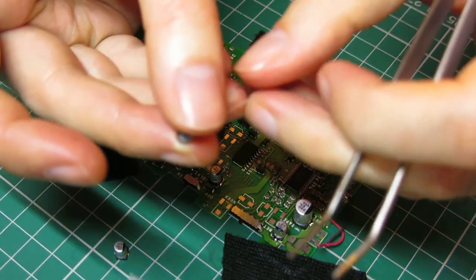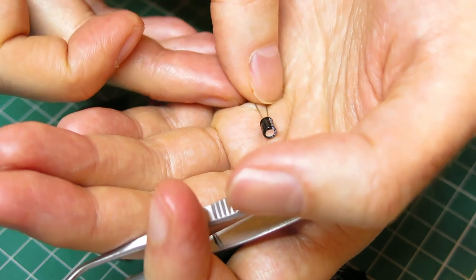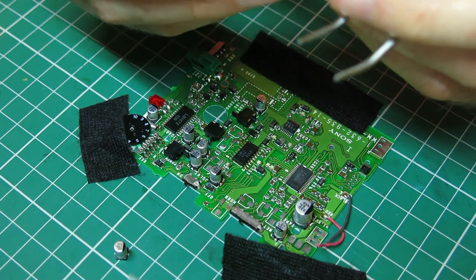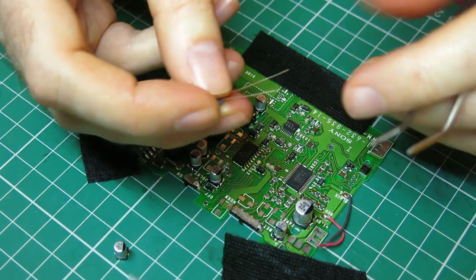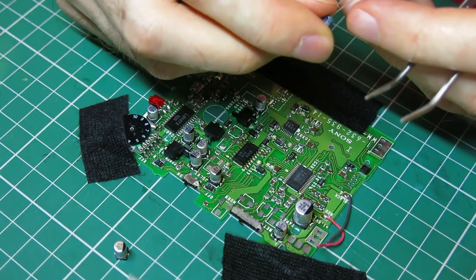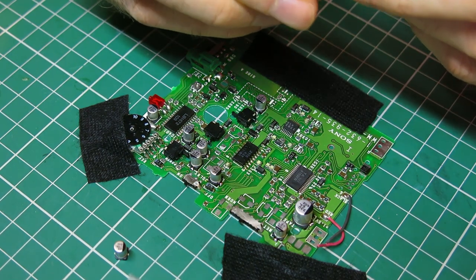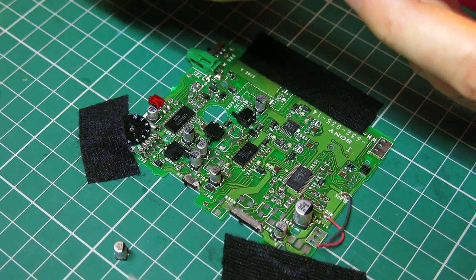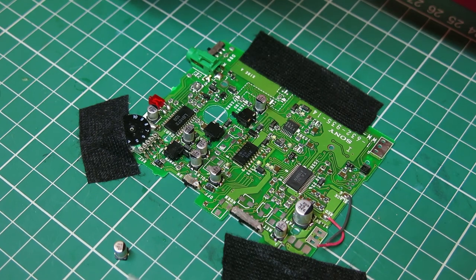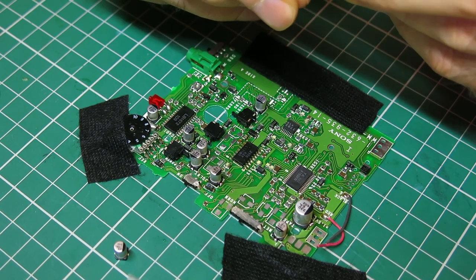For the little sideways ones, what I've got is a regular standard very small through hole electrolytic, and what I'm going to try and do is get it the right way around. In this particular one we want the negative pointing towards my left, and I'm going to make a bend very close to the body of the cap. I'm going to bend that towards me, so it's going to bend back on itself,